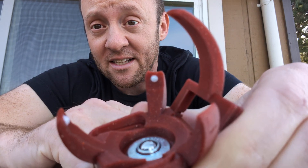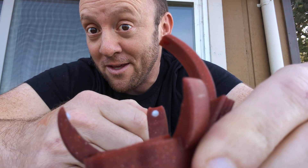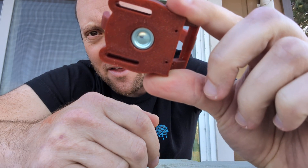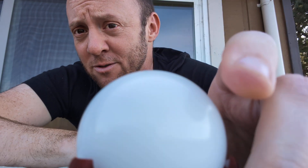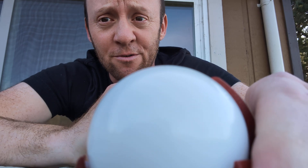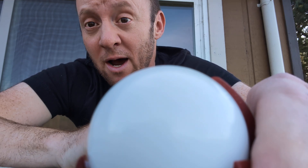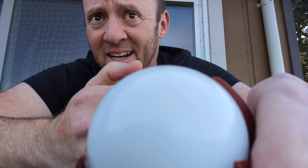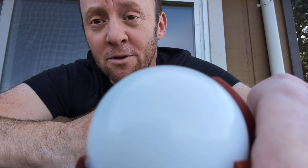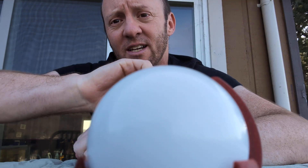I thought this was really fun. I hacked this up and it's in the Svalbard Open Trackball Repo — this is something I'm happy for anybody to do. This does add the entire height of that BTU to the mount, so doing that with a 50mm ball would make it incredibly tall and not really usable in a Svalbard as it sits. But if you like that BTU feeling and want to try this with a 34 or 44mm ball — a 44mm ball would be about the height of a 55 — that's really only usable by somebody with huge hands, around 200mm from tip of middle finger to wrist crease, but there are some people out there like that who might find it really fun to try.